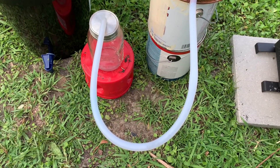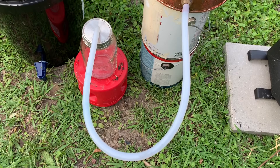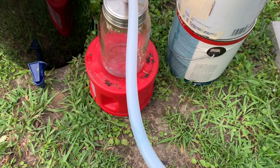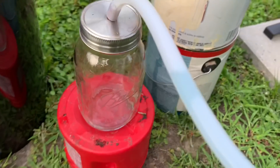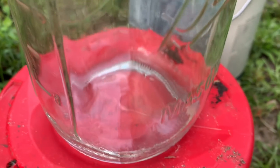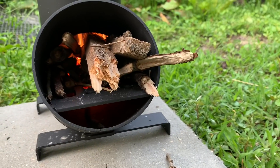It's running through and it's coming out green — see that? Focus right here, that's where it's collecting. That vinegar is cleaning all of that out of the line, leaving that green liquid in here. That's just copper corrosion. So we're going to finish heating it up and come back at it.